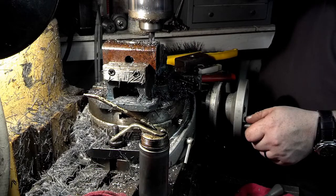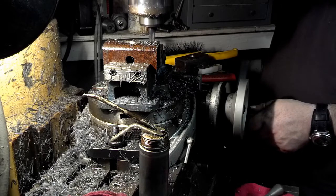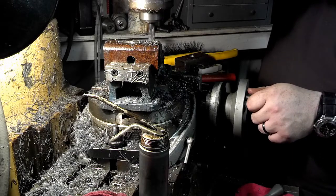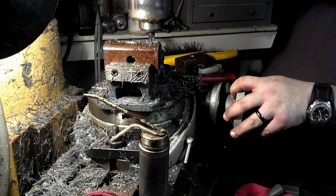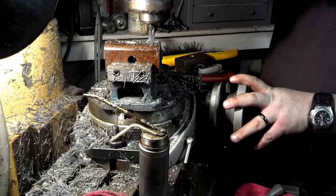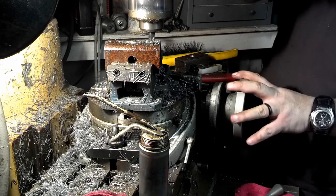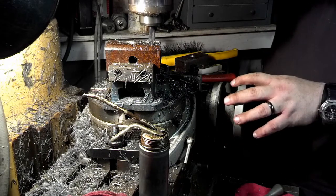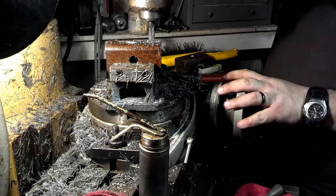Got one of these adjustable Bridgeport quill handles. Mine had the original Bridgeport handle and the handle broke off, so I bought one of these adjustable ones. And these things are so nice. The little trick I figured out is the set screw that's supposed to hold the thing on there, a pointed grub screw, and there's a hole, and there's two grooves on the sleeve that the quill handle rides on. There's like 20 or 30 holes that a pin engages, so you can re-index the handle.